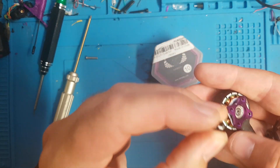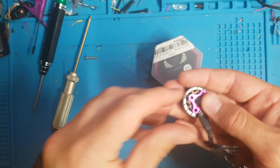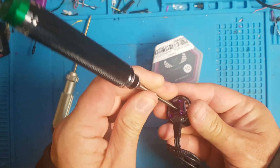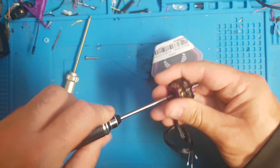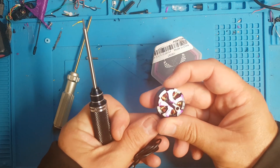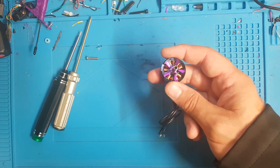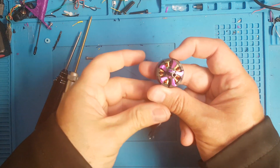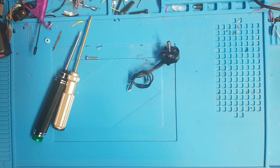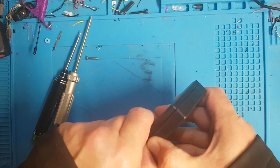It's all very neatly wound — you can see super tight air gaps, and the motor is very smooth with just a little bit of cogging but not much at all. Putting the set screw back in with its little housing — even though it's just an M2 bolt or screw, it seems pretty good quality. There were no issues getting it out and I didn't feel any rounding, which you quite often get. The one thing about 3B motors is they had a tendency in the past — not so much on later versions — to run hot, but they gave exceptionally good performance, so it'll be interesting to see what this does in the air.